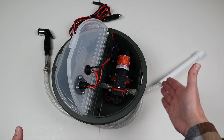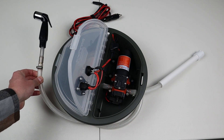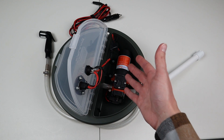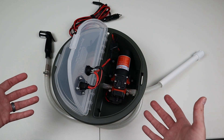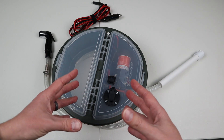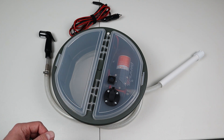You have this pickup tube in the five-gallon bucket, and as the pump is turned on, it sucks the water out of the bucket, pressurizes it to 35 PSI, and puts it out through this eight-foot hose to the sprayer. The basic electronics inside include a power port, a power switch, and a fuse — that's basically everything inside. You clamp the hoses down and it's fairly simple. This design closes in there nicely, giving it a watertight, splash-proof area so you don't worry about your pump being completely doused in water.